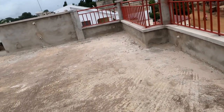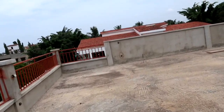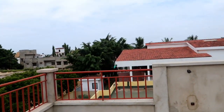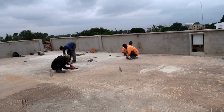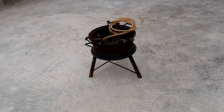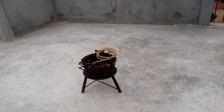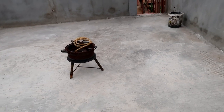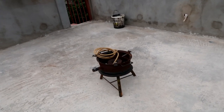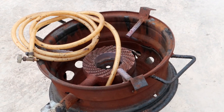The artisans are using implements to loosen up debris. The surface of the rooftop has to be clean and clear of debris and loose particles, if you will, prior to bitumen and its derivatives being applied to the surface for waterproofing. The bitumen, when applied, should adhere to the actual rooftop and not the sediments, the particles, the debris that would obstruct its effectiveness. So clearing of the rooftop is key.